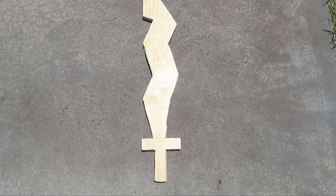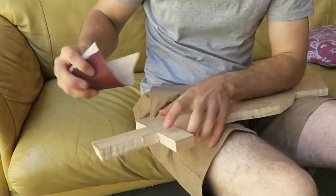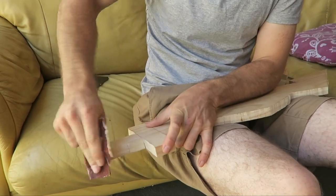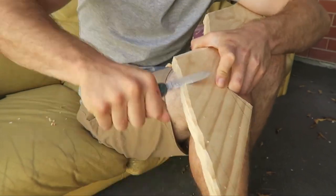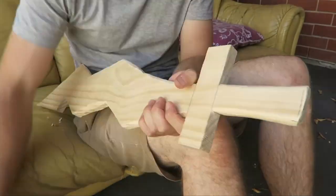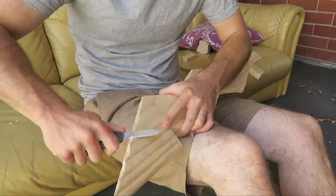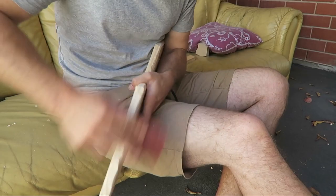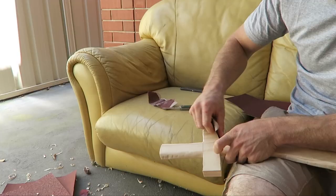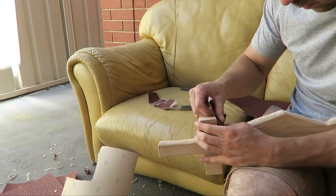After you've cut it out, it's time for sanding. I sanded the actual handle down and sanded the corners until it was round and cylindrical. I didn't want to make the edges of the sword too sharp, mostly because it's wood and that would take forever, but also because if you want to take it to conventions and it's sharp, they will take it away from you. I did use a pocket knife to angle the edges down into roughly a point, then mostly used sandpaper to get it all nice and smooth.